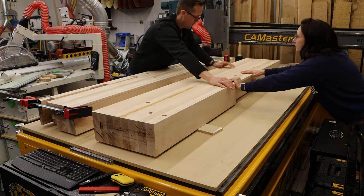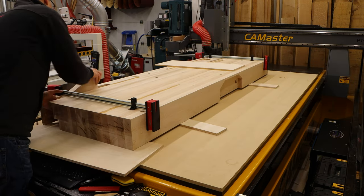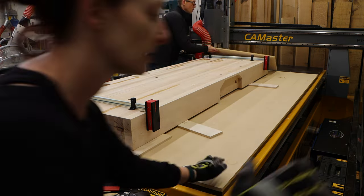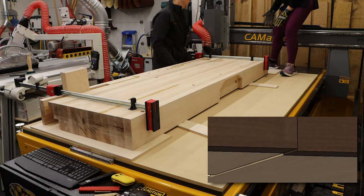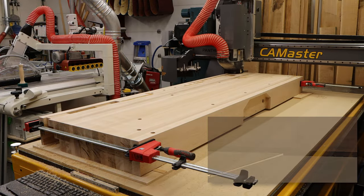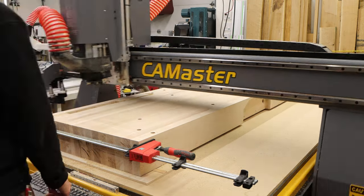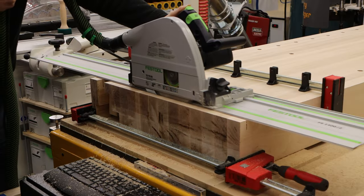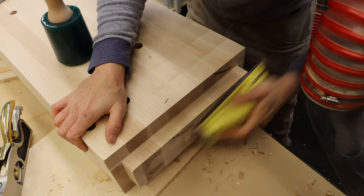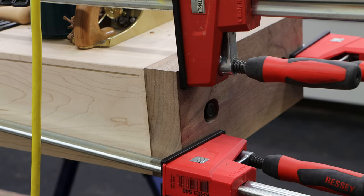The sliding slab rides 1/16th of an inch above the base; however, the fixed slab is flush with the base. To compensate, I've married the slabs on Baltic birch plywood that's 1/16th of an inch thicker on the sliding half. Now that I'm re-flattening the tops, they should realign later when installed on the base. While the slabs are married, I also want to cut them to final length — this just needs to be done while the slabs are married so that the ends match perfectly.